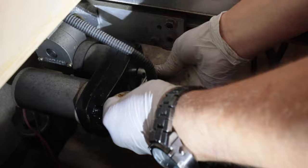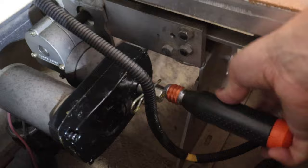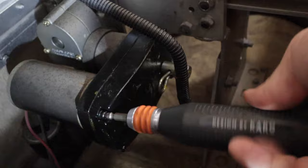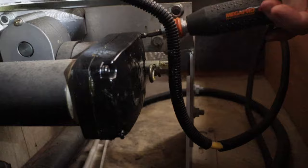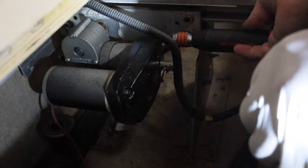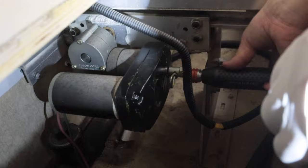Don't forget to put the manual crank head on again. You can start to put your screws in — you want to alternate screw heads so that you have even distribution on the torque. If you had a power driver you could do this much quicker, but my power driver decided to take a dump the other day. Once you get them started, go around again to make sure they are definitely tight. Fairly simple fix — most people can do this.